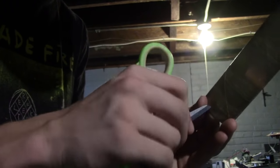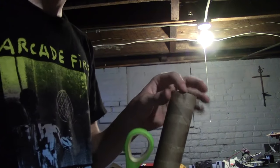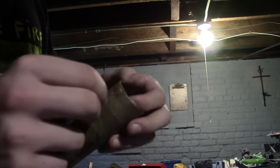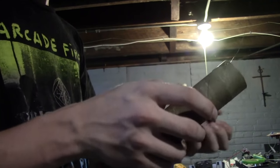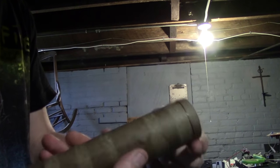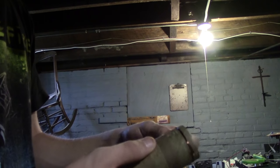Next, puncture a small hole in the bottom of the tube so you're able to thread your secondary winding through before you start winding. You don't want to use tape because tape can unravel, it's pretty unreliable, it'll wear and tear over time, and could even leave sticky residue and ruin your coil. As you can see, I just threaded it through, did a little loop, and now you're just going to start winding it around in a big spiral coil until you fill the entire thing up, then do the same thing at the bottom — puncture a little hole — and you'll have your secondary coil.